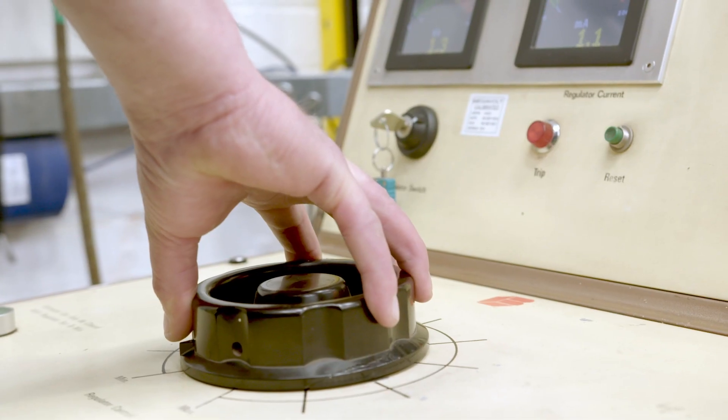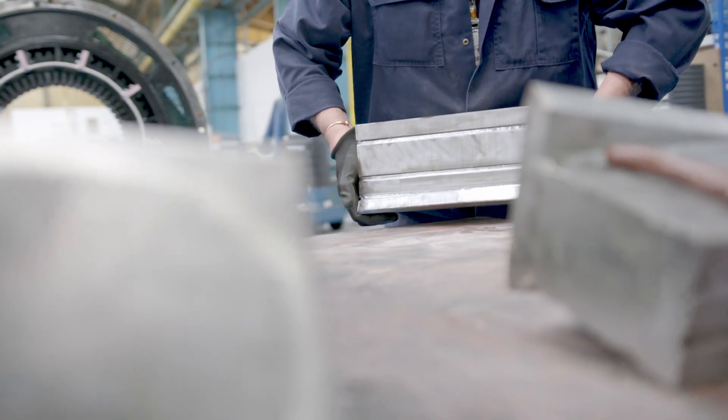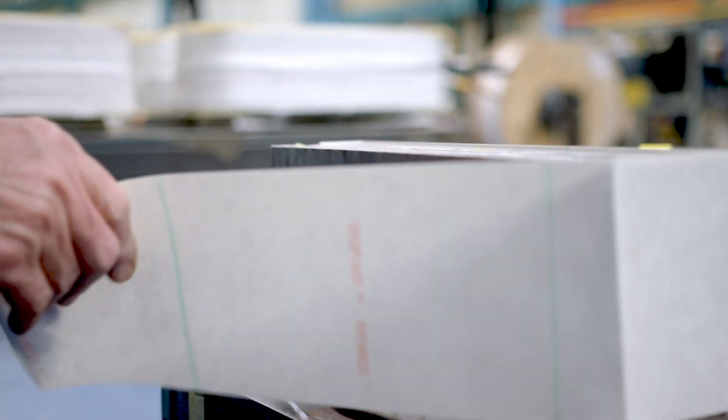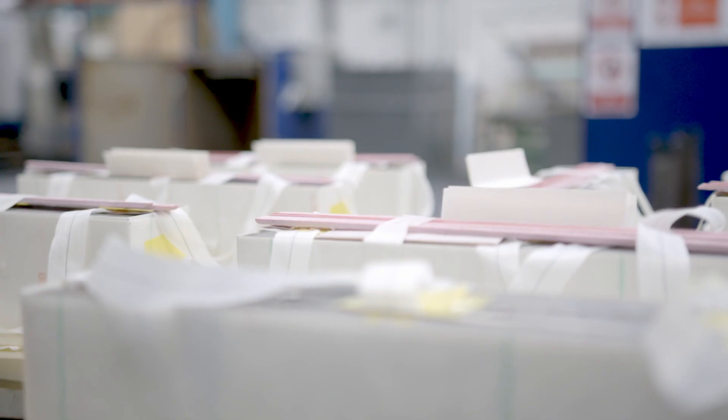We went through a more rigorous test and found that there were actually also faults on the rotor. We had some discussions with the customer and it was decided that a full stator and a full rotor rewind would be performed, and that we would work with the customer to try and improve the insulation systems and make it a better product when we deliver it back.